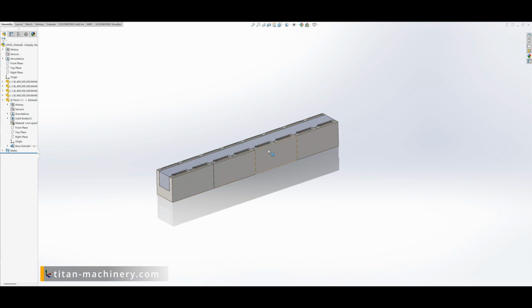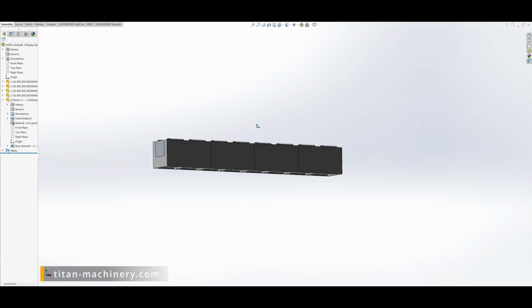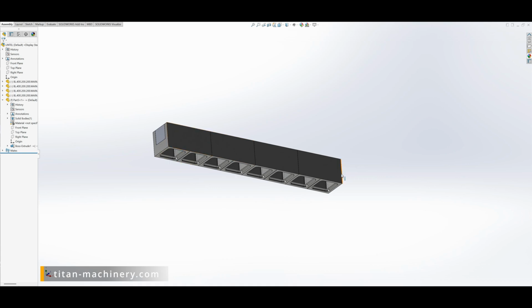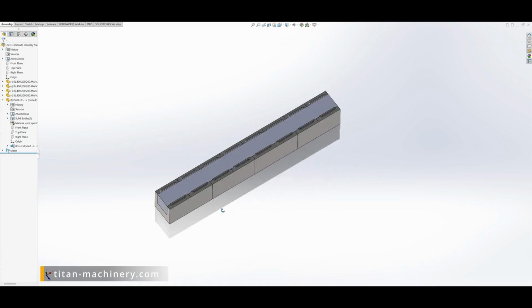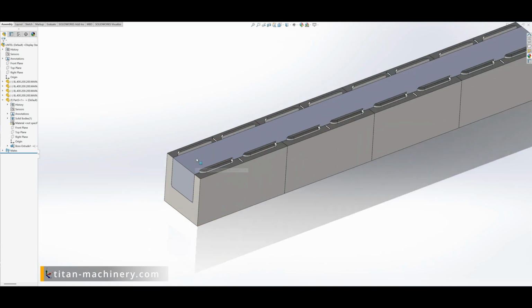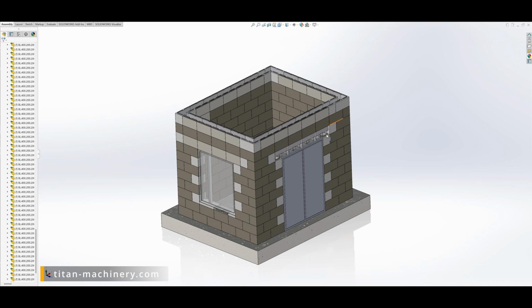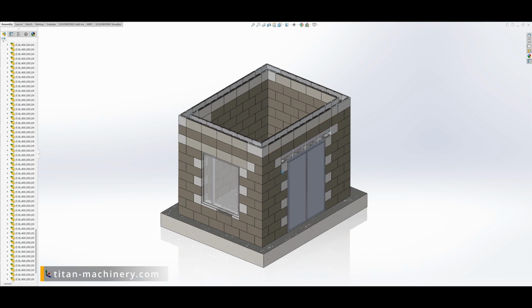So you put together several blocks and install some steel reinforcement, steel rebar inside, and pour concrete. After hardening process, you have lintel like this. This surface is also flat, no problem, and you can continue your block laying process without any interruption, and I hope it is clear. So this is lintel block, which is produced using these U-shaped blocks.